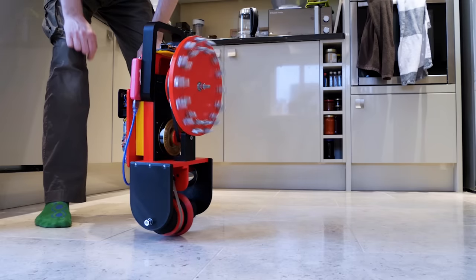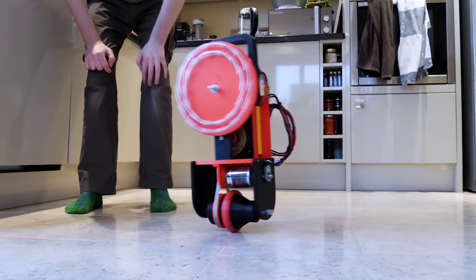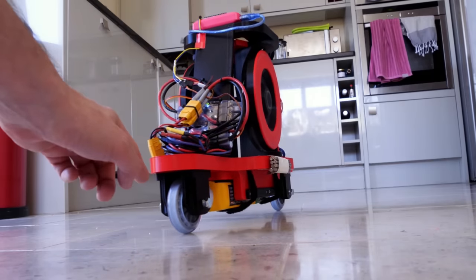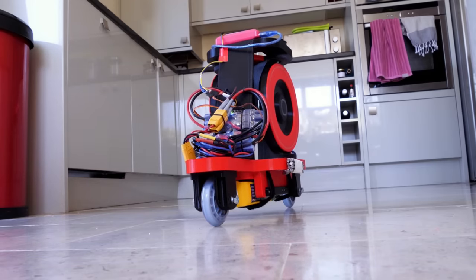I also built a one-wheel balancing robot which uses the reaction wheel to balance sideways and then balances back to front like a traditional two-wheel balancing robot or a Segway. Note that this is different to a control moment gyroscope, which uses a constantly spinning mass moved in a control axis to exert a perpendicular force in another axis.